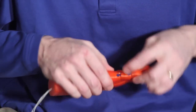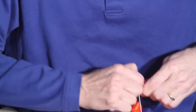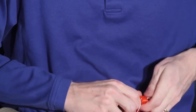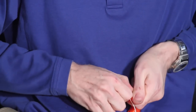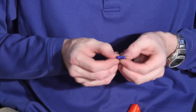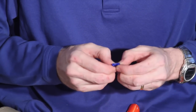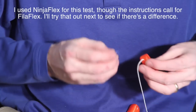As you can see, there are these joints in the middle there made out of the blue flexible filament. I'll go ahead and slide one of these out so you can see what that looks like. They fit in there pretty tightly, but they're not hard to get in as far as the different phalanges are concerned. Getting the fingers onto the base of the hand proved to be pretty difficult, and that could probably be improved. But this is the design for the hinges — it's essentially got a bulge on each side that holds it in place, and then the part in the middle is the part that flexes. It's really quite strong, so I've been pleased with that so far in the testing.